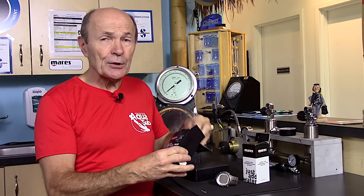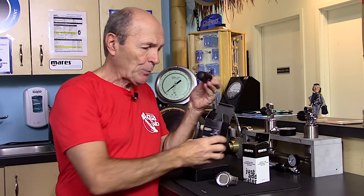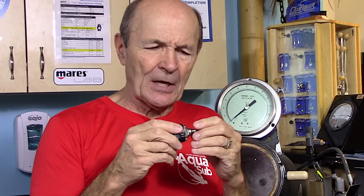The transmitter, which goes onto your regulator — onto a high-pressure port of the regulator — it essentially takes the place of the SPG. It goes into the SPG, a submersible pressure gauge, high-pressure port. This is the transmitter. That's a neat device. It screws in properly, snugly, with an O-ring and so on, into the high-pressure port on your regulator.